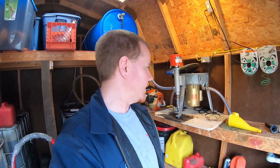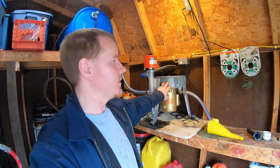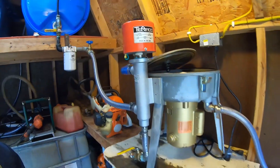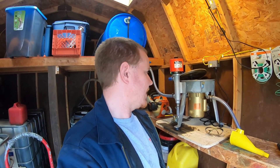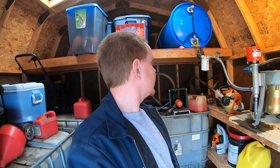That pretty well covers it. It's plumbed pretty simple — I just followed the plumbing instructions that came with the centrifuge. I may end up changing this a little bit. I'm thinking about taking one of these fittings out here and venting it outside, to let some of that moisture evaporate off. I may contact WVO Designs and see if that's something that would affect performance or not. I think it would work out really well, but we'll see — I might give them a call and find out. So if you have any questions, feel free to comment. If you haven't already, please subscribe — we appreciate you watching.